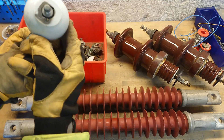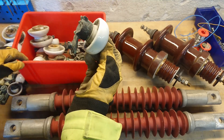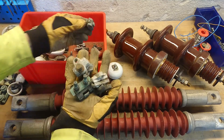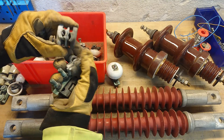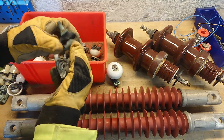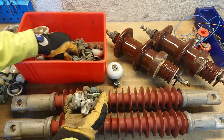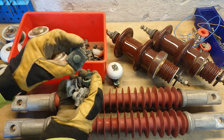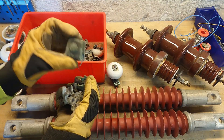Another insulating part here seems to be part of a clamp — this could be some kind of wall mount, and you can connect up and have something going across here. Then there are a lot of different other clamps: here you can connect two wires together, another type of two-wire clamping, another side-by-side type clamp, and a fourth version. It says you can mount 25 to 35 square millimeter wires in this.